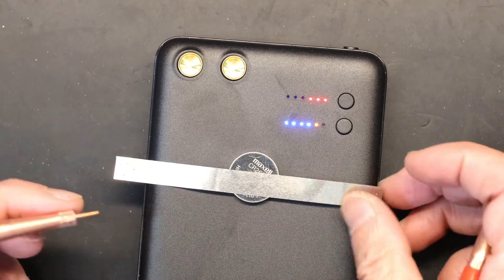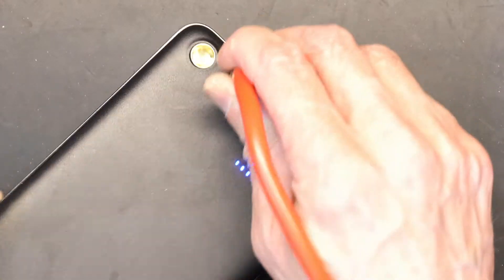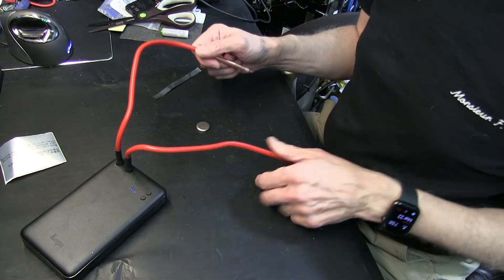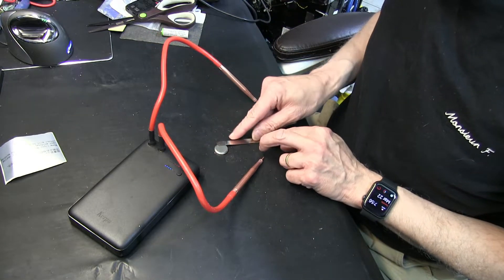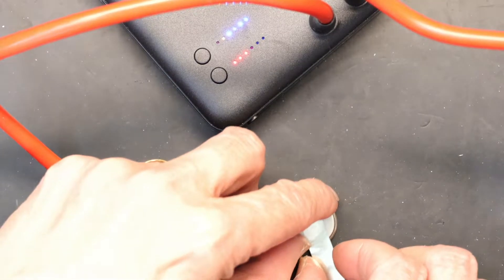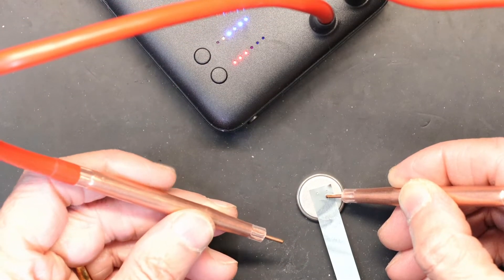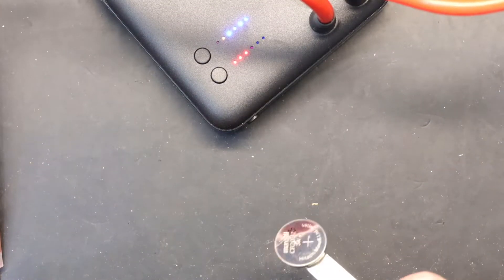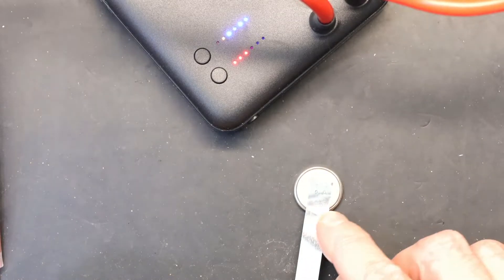Level six welding power is very strong for a small battery, so I'm going to set it to level three. I'll plug in the welding cables and place this little plate on the watch battery. As soon as I touch the second tip, it gives me one second before the current goes through — and it's welded. Pretty strong for level three.